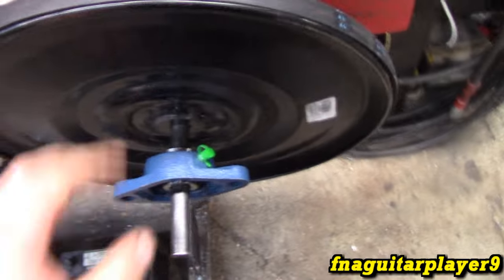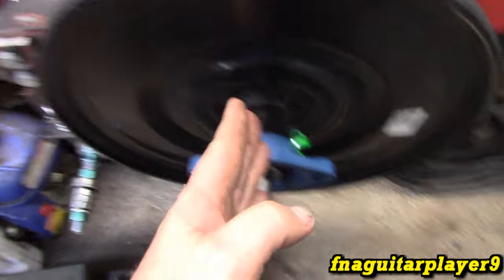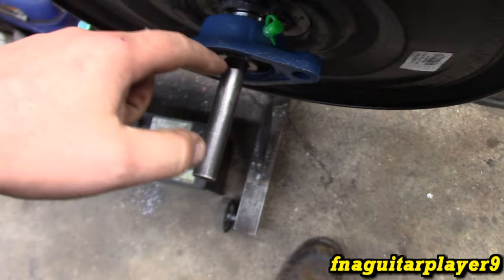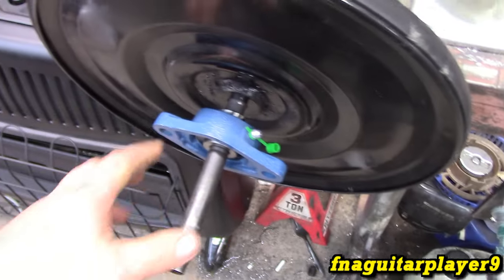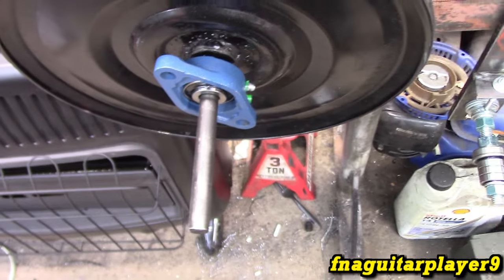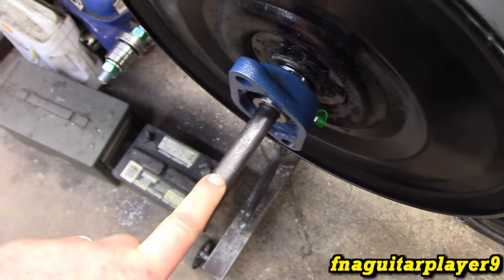Now the newest problem: once I had the blade on there doing a test fit and tensioned it, the tension from the blade is flexing the 5/8-inch shaft - it bent probably over an inch - both of them. So I'm going to put an extra pillow block bearing on there with a piece of bar going to a threaded rod, same thing on this side except that one will be more for adjustment. So it will be three bearings on this side. The third one is just filling the space and taking the load off it. Something I should have seen way before now. The simplest way to prevent this was to use a bigger shaft - it should have been probably at least 1 inch instead of 5/8-inch.